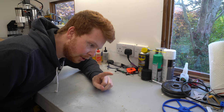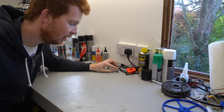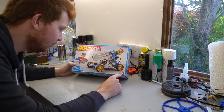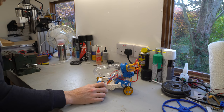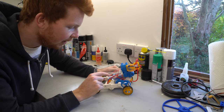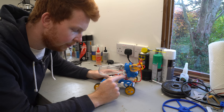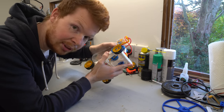I hope you can forgive me for this, because I've cheated a little bit on this project. Since my design wasn't working with the syringes not being able to withstand the pressure, I've decided to buy an air powered engine car kit - quite an interesting toy made for ages 10 and up, which I'm apparently allowed to build. It runs two slider valves, one per cylinder, and is geared up to the rear wheel so one cycle of the piston equals about eight cycles of the rear wheel. It also has a built-in pump, which is quite cool.